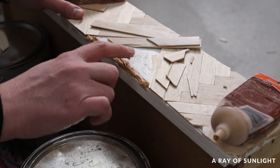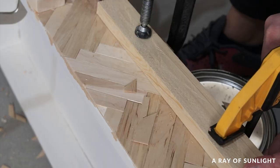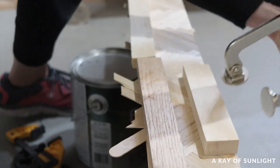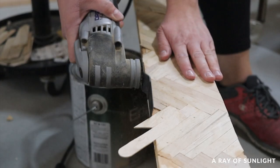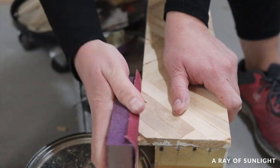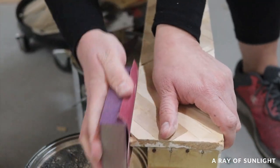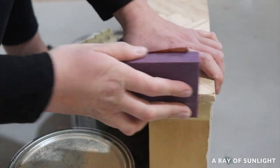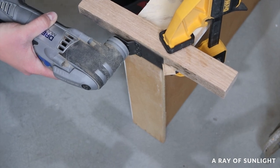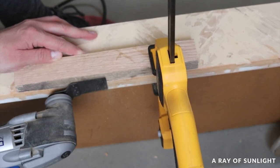So I filled the detail in with wood filler and glued the sticks back on. The next day I cut the sticks again, and I failed again in some spots. At this point I was so close, so I sanded the edge of the sticks with 80 grit sandpaper — I didn't want them to stick out past the edge of the drawer or snag anything. Then I glued the last couple of pieces back on. The next day I cut them again, but this time I clamped a piece of wood over them so they wouldn't wiggle off from the saw, and it worked great.